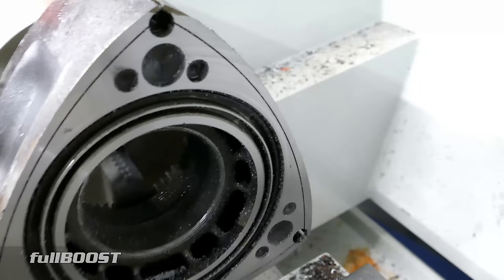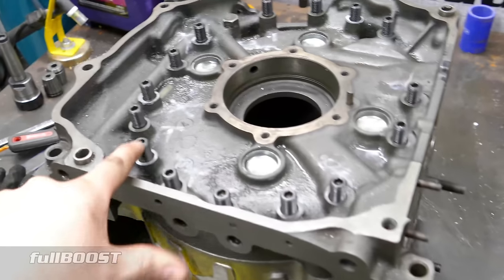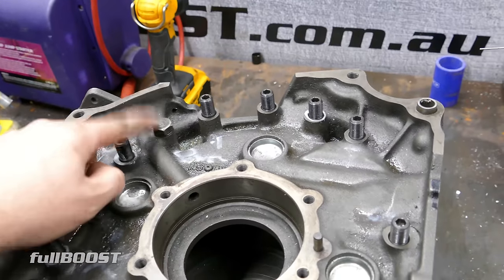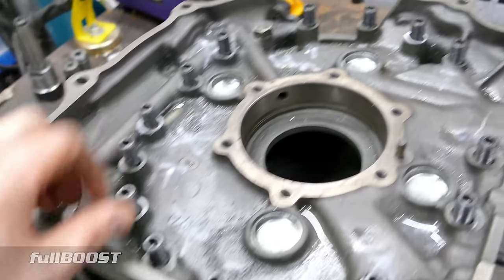There we go — a nice machined surface. We'll continue that and take another little bit off here as well. An important part of any build when you're machining anything is to make sure it all goes together properly before you build it. You don't want to find a problem or really tight clearance after you're halfway through building. So we've got all the studs in. We left this one as a dowel because that's how it was — it was already dowelled there. We just re-drilled the housings to fit the dowel. All these studs now are bottomed out, going perfectly.